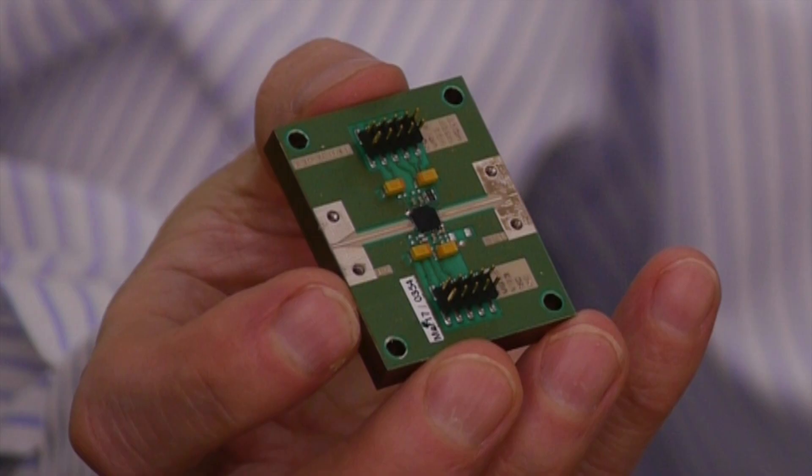Could you tell me a bit more about the different types of packaging that can be used at millimetre wave frequencies and their individual pros and cons? The most common one is the overmolded plastic. A lot of microwave ICs go into the overmolded plastic QFN — the one I showed earlier. This is a 28 gigahertz PA for 5G applications, in a 4 millimetre by 4 millimetre overmolded plastic QFN package, solder attached to a PCB. This sort of package we've used to certainly beyond 30 gigahertz.